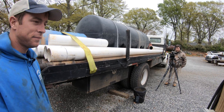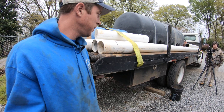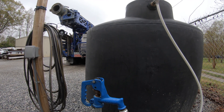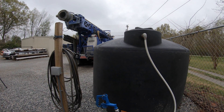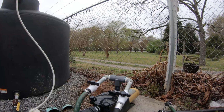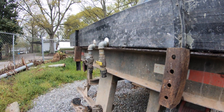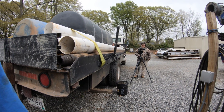Got this big old water tank to fill up, and until recently we'd have to wait on one of these guys to sit here and fill it up — regular old yard hydrant, take about an hour to two hours to fill it up. Not anymore. Got the 1500-gallon tank here with a little pool pump coming in here running off 115 volts. These hoses here tie into the back of our truck. Fills it up in about 15 minutes versus an hour and 40 minutes.